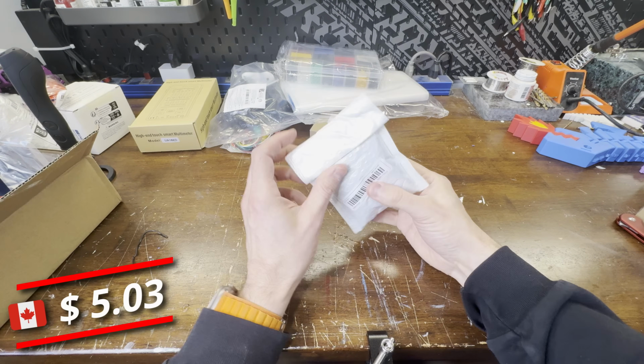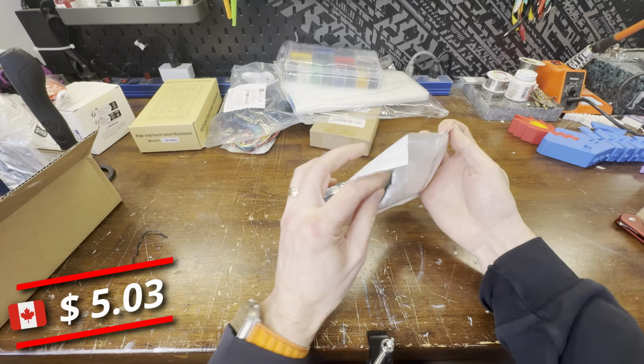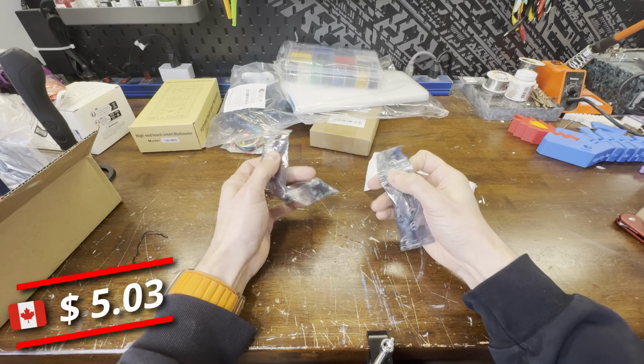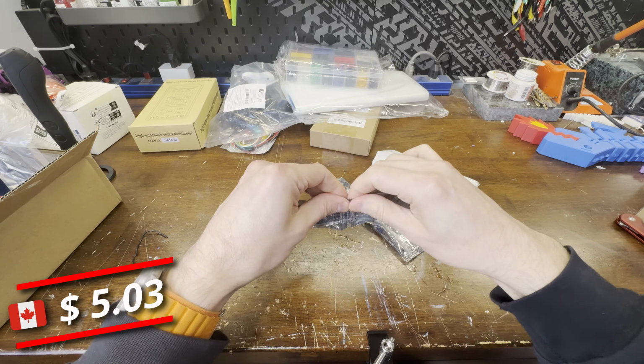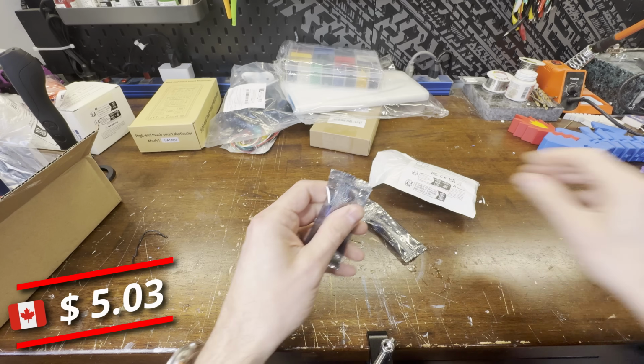If you're using electronics in your projects, one common problem you're going to run into is having the proper power settings for different components. You can think of these buck converters as like dimmer switches. They work anywhere between 3 and 40 volts, and whatever you're inputting into the buck converter, you can then dial it back down to whatever voltage you need.